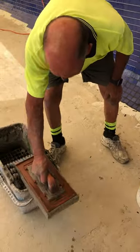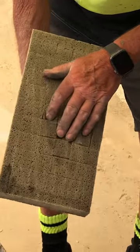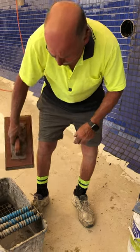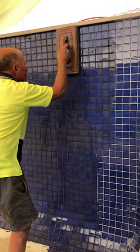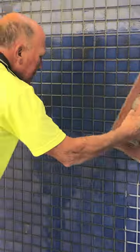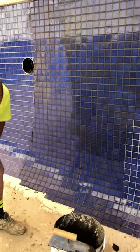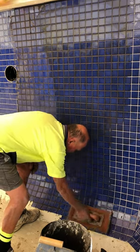This is a Raimondi Wash Boy and the sponges have all got squares on them. That means that all the stuff I collect in the sponge doesn't get caught up in the sponge — it ends up in the bottom. There's a little grid underneath here. Now washing — you're not having to be very particular here. We're just going to give a scrub-up type wash, just like that. This is basically smoothing out the joint to a fair degree and taking a lot off the tile.